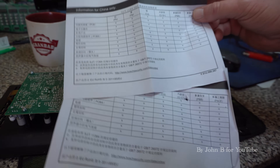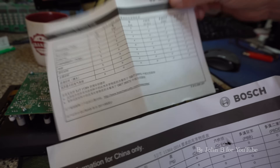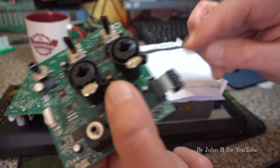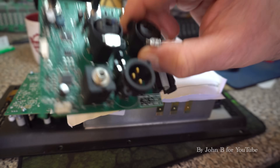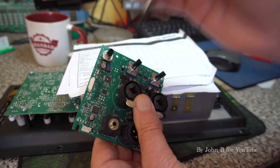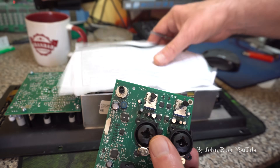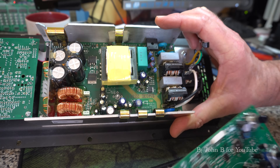Here's proof — two bits of paper supplied by Bosch. I don't know the connection between Electrovoice and Bosch, but one came with each amplifier board. He bought the input board as well because he damaged the connector that runs the LCD display — that's something like 70-odd quid. There are two microcontrollers down here, probably for digital signal processing, like the Mackie Thumps with DSP. So over 70 pounds for the input board and nearly 200 for the main board. I told him straight away: that's not a thousand watts — too small.